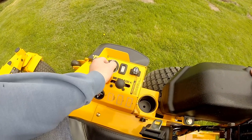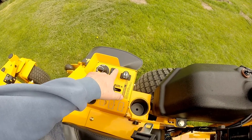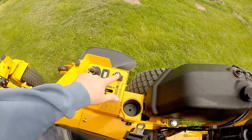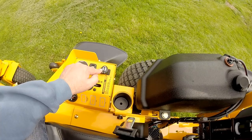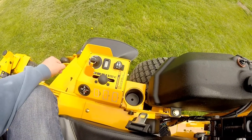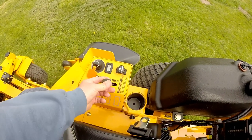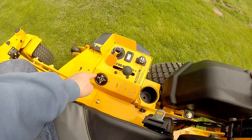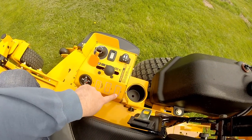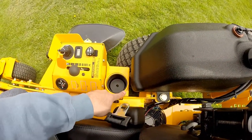On the right-hand side of the machine you have your control panel. There's a little guard around the key switch, and you have your key switch to start. Right behind your key switch you have an hour meter with a little button — hit that button and it'll give you RPM; hit it again and it'll tell you when your next oil change is. Right behind your hour meter is the PTO switch, which turns on your mower deck — pull up on the PTO switch and the mower deck will come on, push it down and the mower deck turns off. Right below that you have your throttle — all the way down to slow or up to fast, controlling engine speed. Down below that you have your fuel gauge with a gauge for each side, and there's also room for other switches like a power-assist bagger or auxiliary switches for lights. You also have a cup holder.